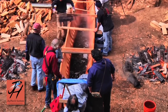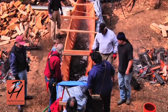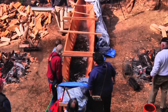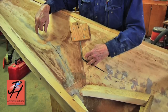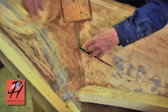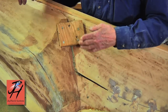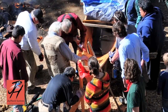I didn't expect the crack to happen there — I expected it down along the chines. I think it's because I had it restricted for too long with a 2x4 cross screwed into the top of the gunwale so it couldn't move; I probably should have taken it loose. In the spreading process, the canoe cracked right here where it's very thin — about three-quarters of an inch, actually closer to five-eighths of an inch. It runs right into a big solid thick area, and when you get a thick area next to a thin area with the grain running like this, that's a potential weak spot. There's too much tension concentrated in one spot, and as a result, this opened up.